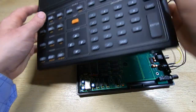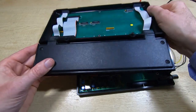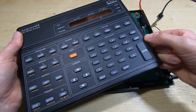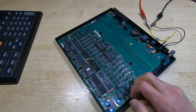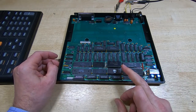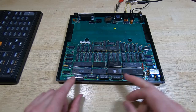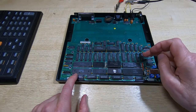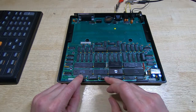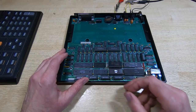There are two major parts: you've got the keyboard and display, which comes off as a single unit - it looks like it's broken here but this is because of the display tilt. We'll have a look at that once it's reassembled. Looking inside, I have updated the firmware though I haven't put a sticker on it yet. We also have the processor, the ROM, some interface chips, a timer, and then this row of chips along the front - these are some programmable logic devices and PALs. I was hoping it wasn't a fault with those; I've got the code for them but they're a bit of a pain to get hold of.